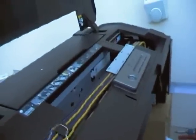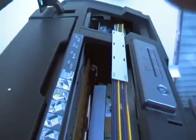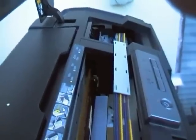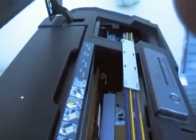All I'm going to do to test that it works is go to the ink settings, do a print head alignment, and it should print something out. The USB cable is set. I'll need to engage the PE sensor — as soon as the platen starts moving I engage it to let the printer know that paper is in there. The platen started moving, I'll trip the PE sensor. The head would have tried to find the end of the paper by now — what used to happen is the head would come across, the tray would move out a bit more, the head would go to the middle, and you'd see the tray go backwards and forwards while the PW sensor tries to sense the edge of the paper, and it would start printing exactly where it should.